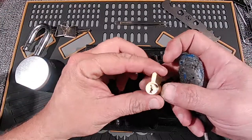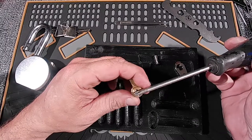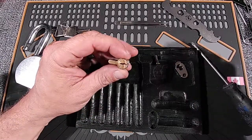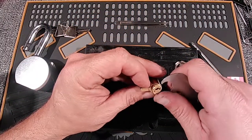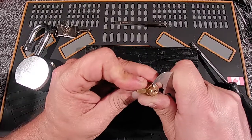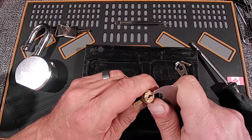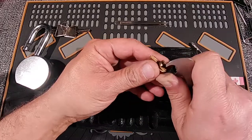These ones at least are not of a bypassable design — you can see that. This actuator part is not horizontal, it's vertical. I move the bottom of the clip, I just turn it, usually, to the bottom part so that it grabs in the bottom of the keyway and then I can just push it out from the top. Just like that.